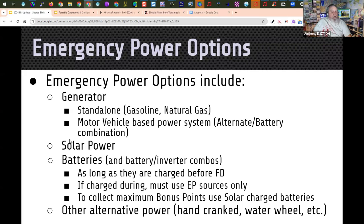As a matter of fact, if you're going to use solar power, you're probably going to need to use a battery in your system anyway. There is the potential that you could operate strictly on solar, but of course you wouldn't be able to operate at night. And one of the problems is, even if the sun's out, clouds pass over it, and you can notice a very big drop. So I don't know of anyone that goes out and operates just solar. It's solar and a battery combination.